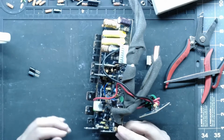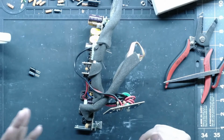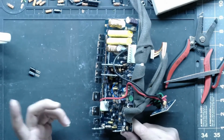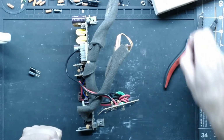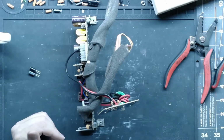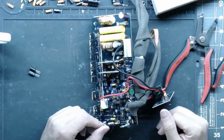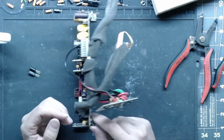It will be fine. Especially, I always put a little message in there when I return the amp: when you're done watching TV or listening to music, just go to the back of your sub and turn the power switch off. It takes a second to do, and you will quadruple the life of the equipment if you simply turn it off. There's no reason why you need to leave things powered on 24/7. One, because it adds up in your electric bill and you're paying for it when you're sleeping. That's kind of crazy. And two, because you're going to end up paying for it again when you pay me to fix your amp. So take the couple minutes and flip your power switches off when you're not using this stuff, and it really does make a difference. The caps and everything just lasts longer.